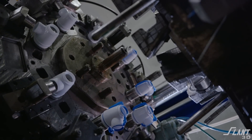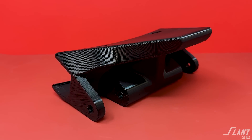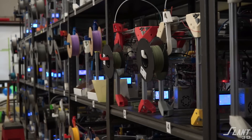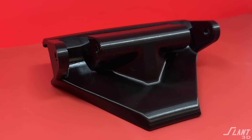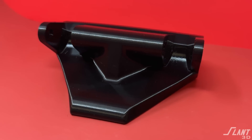Now the question is, why wouldn't they just go with normal production techniques? Well, this type of design can't actually be produced with traditional manufacturing because it's too chunky — it would shrink with all these thick walls. You'd end up having to cut ribs into it and then you have open sides that look really gross, or you'd have to stamp it or carve it out of metal and now it's really expensive again. So 3D printing is a really good way of making this type of functional and durable accessory because you're able to get a nice chunky design that has a lot of structure and reliability without a lot of cost.